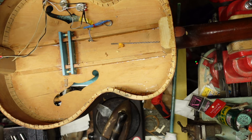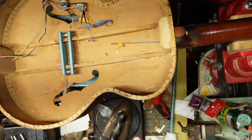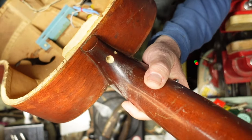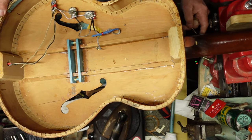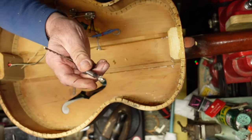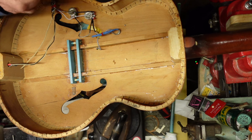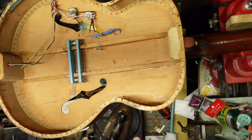Then you want to remember that you're going to need a shoulder for this to sit on. So the hole for the shoulder right here, you can see there's a bigger hole there and then a smaller one inside. That shoulder is drilled with a Forstner bit like this. Okay. Now, these Forstner bits have a nub on them, so the pilot hole that you drilled with the long bit fits that. You don't want to drill the big hole going through first.